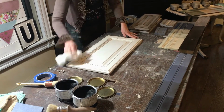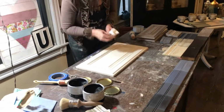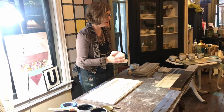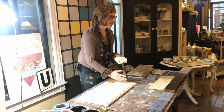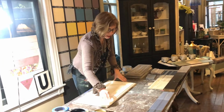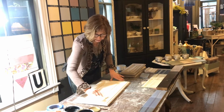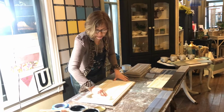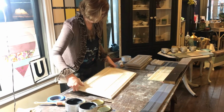All I'm doing is evenly spreading this out. Because what happens is, if I would brush this in, like you used to watch people wax and they'd be scrubbing like this, pushing the wax in as hard as they can. Well, what happens then is the wax gets burnished in one spot and it won't evenly spread out to the next spot. So if I go at it very, very lightly with no arm muscle, I get the whole surface evenly dispersed, and then I can rub it back or wipe it back a little bit. And you want to flip your cloth occasionally, because if you keep rubbing it with the same spot on your cloth, it's not going to spread.